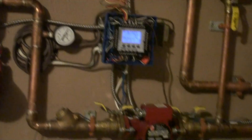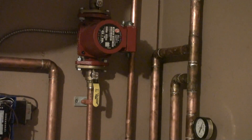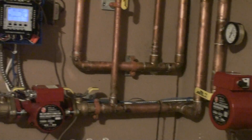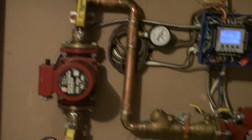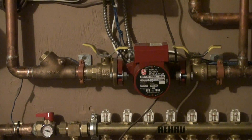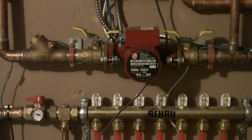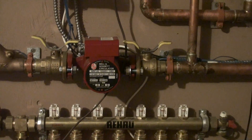This loop in the middle with this little pump is called the injection pump or mixing loop. It comes from the heat pump loop — those two lines — and mixes a little into the mixing loop. The injection pump injects more heat when the floor asks for more heat, or slows down if it needs less heat. It speeds up or slows down for the amount of heat that's needed.